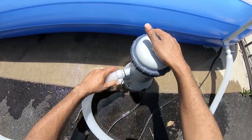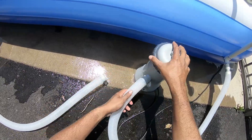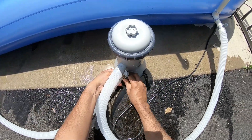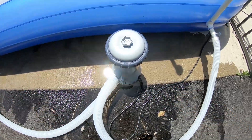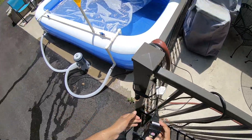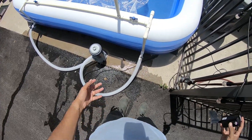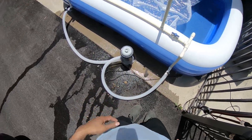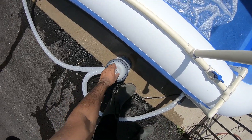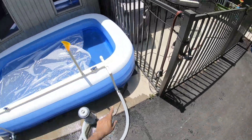Alright, input comes in the top. Let's get the system running again. Just by itself it doesn't have enough suction power to suck the water down. So in order to get this running I open this valve at the top and this one here, and I've got to fill it up with water manually first.